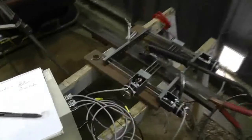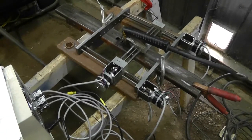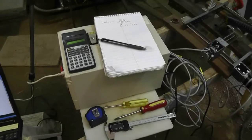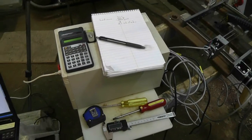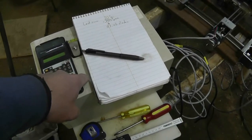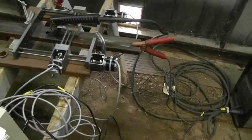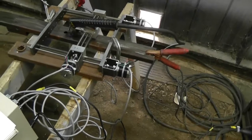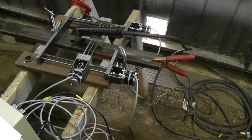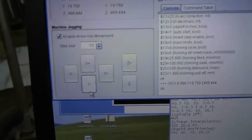So I've been sorting out a few different things here. I've been trying to figure out why it's not feeding the amount I was expecting, and I redid my calculations. That's what it's supposed to be to calibrate this GRBL software. But that seems to be off by a factor of two. I can't figure out why — the only thing I can think of is that it could be the steppers, which I thought I configured to full steps, or maybe they're half step. Or maybe these motors are 400 steps per revolution rather than 200. I think this came up once before when I was trying it with the old controller — those motors are probably 400 steps per revolution.